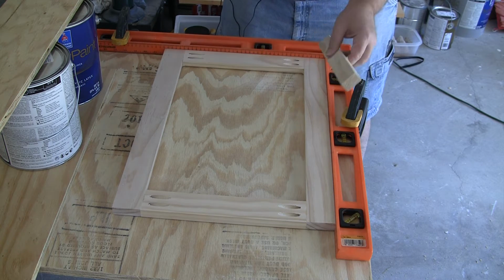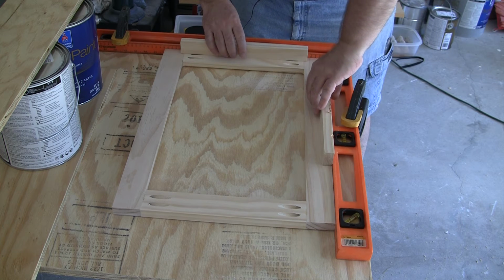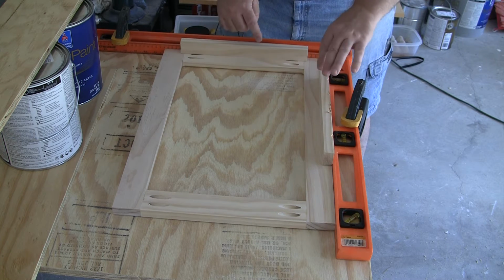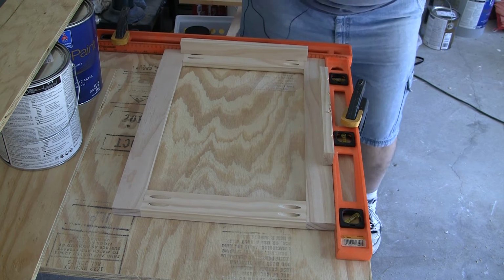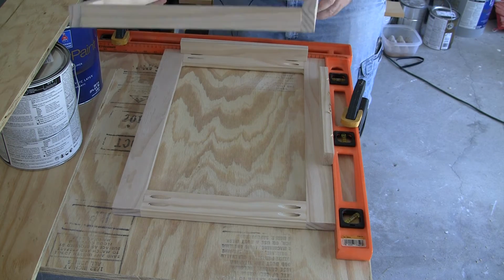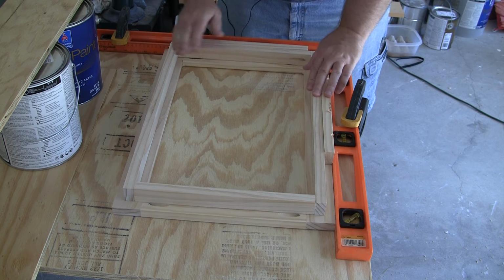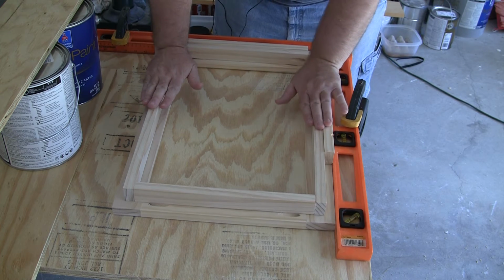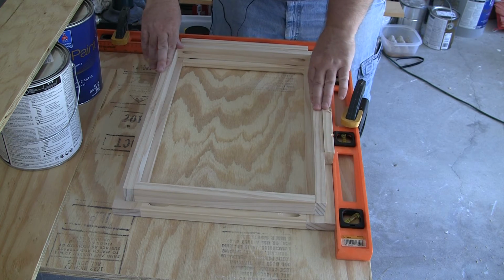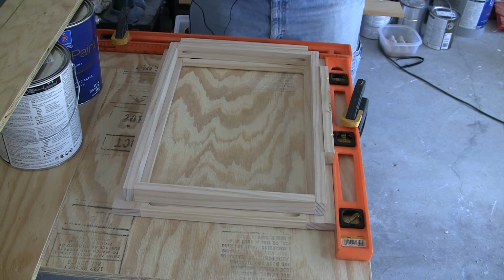I'm then going to take 2 pieces of 3/4 inch wood, put those on the side and the front up nice and tight, and I know that it's going to be a 3/4 inch reveal around the entire side with a 1/2 inch on the inside. So then I can take my back plate, my back pieces of wood, slide those right into place, of course after gluing it. I'll then be able to take some weights and push them down on top of here to have a good glue. Let it sit for a while, and at that point then it should be done, ready to go, ready to put the cork board in. Let's see how it goes.